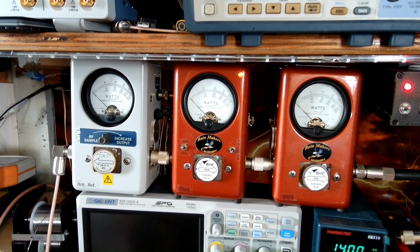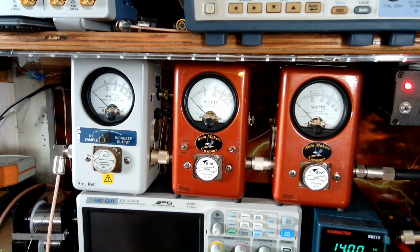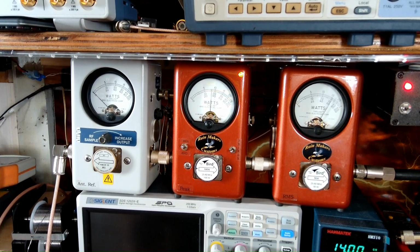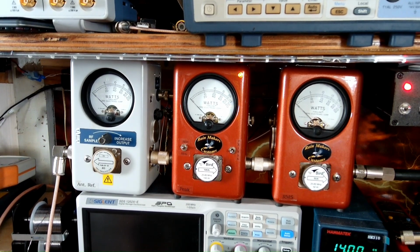On the FM side, I did turn this down a little bit, mainly because this radio is capable of about a 40-watt carrier, but you really don't want to run it that high all the time, not if you expect it to last. So right now I've got it set at about 32 watts on the top end. Like I said, I didn't turn it down a lot, but I did want to turn it down a little bit. If we run it at 3 o'clock, you're going to be about 26 watts. So that's at least in your good safe zone and comfortable on the finals without any damage. So should work great for you if you decide to use the FM as well.